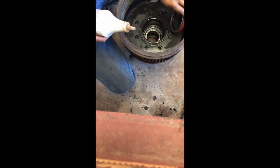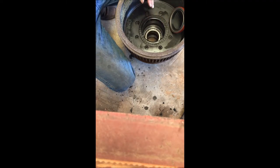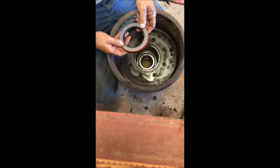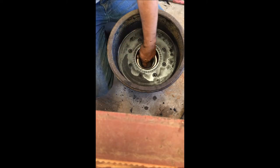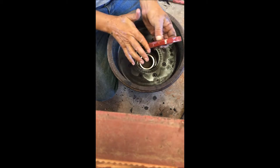I always like to lubricate the bearing. I don't like to overdo it because it'll be running out before I get everything together, but I don't like putting things together dry — I've seen disaster happen when you put things together dry. I'd rather oil them up a bit. Some people don't like to get their hands dirty, but the bearing's in. This is the oil side, this is the air side. Some people put sealer on here but I think a little bit of oil doesn't hurt.